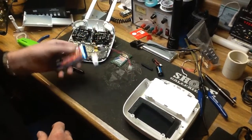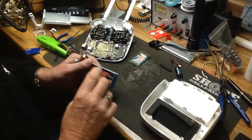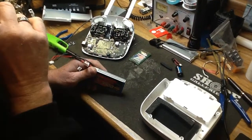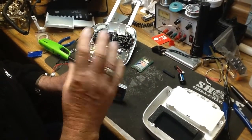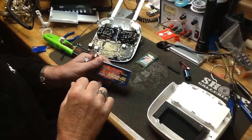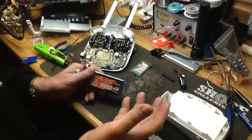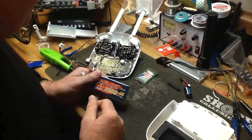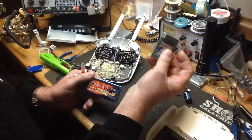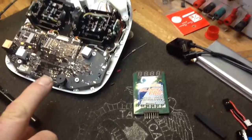We're back at it again and from all aspects it looks like this will work. I cycled it four times — I put it all together and ran it with temporary connections and with the battery. It charged, cycled up, I let it run down and back up again. I also monitored the cells with a monitoring device and it shuts off automatically from the unit itself.